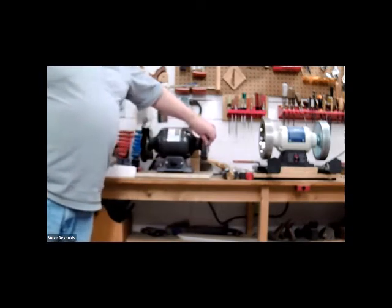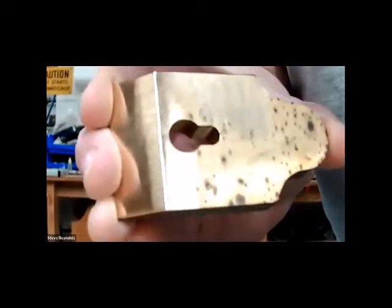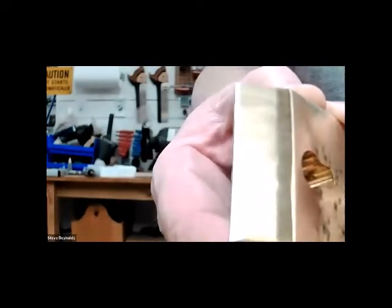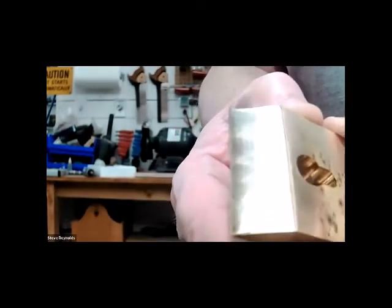And this deburring wheel is an idea that Dave Endries gave me. What it does is it's like a grit in a rubber medium. You've seen the sanding erasers. Let's see, something I've worked on. I don't know if you'll be able to see this at all, but you can see where this brass piece was starting to corrode and get a little bit nasty in places. I took it over to that deburring wheel and was able to put a shine on this brass piece in about 2 minutes. So that's been interesting.